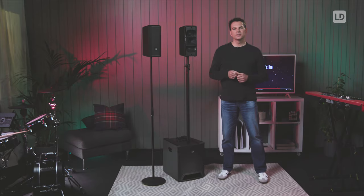The high frequency unit, which is a soft dome tweeter, is within a specially designed waveguide. This whole acoustic design enables us to control the vertical dispersion and the horizontal dispersion in a better way, and this is actually useful to reduce reflections of walls, ceiling and the floor or even your studio table.